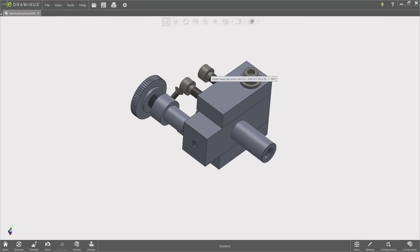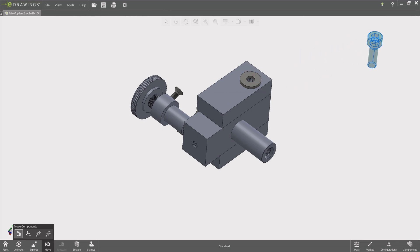After the run of the saw band over the wheels has been adjusted once using the two tiltable axles on the left side, the third wheel attached to this tilter can be used to fine-tune the machine. The adjusting screw is secured with a small cross bolt under which there is a piece of plastic.